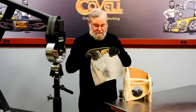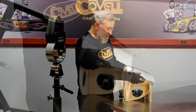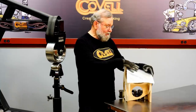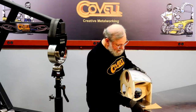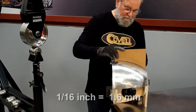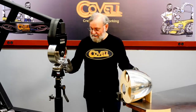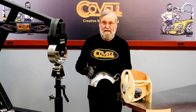Let's try this on the buck again — it is getting better. I have more than half the shape I need, so I'll keep wheeling the same way and gradually bring this up to full depth. I've spent several more minutes shaping this and I have almost the depth that I need. Let's put this on the buck and check it with our template. You can see we're just about where we need to be — it might need to go another sixteenth of an inch, but we're very, very close. I've been working at very high pressure to make the metal move fast, but now I'm going to lower the pressure and keep working to smooth it out and bring it up to the final contour.